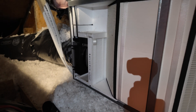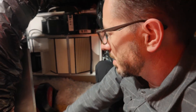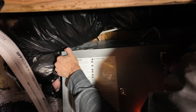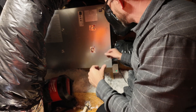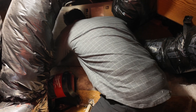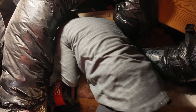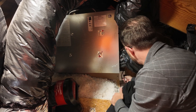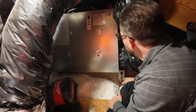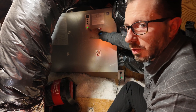And we are now installed. Now it's basically a reverse path — putting the hatch back on. Try to get that done quickly. We got the hinges back installed. Make sure that it's seated nice and tight. Bring your hooks back on. Plug it in for the power supply. Turn it on. And then the last step you're going to want to do is hold down the filter reset button.